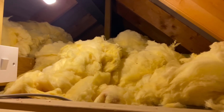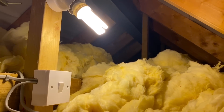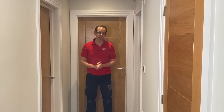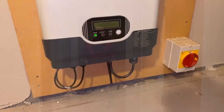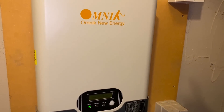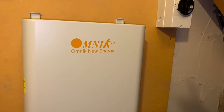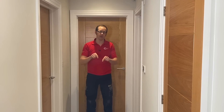One thing to think about in all of these categories is that if the loft is being used and contains electrical equipment — so if you have a lovely loft conversion or a new-built room up there — then you should have a smoke alarm installed, as this should be considered part of an escape route. Or another situation may be that you have electrical equipment such as boilers, photovoltaic equipment or uninterruptible power supplies in an unoccupied loft space. Suitable fire detection equipment should be installed there also, because a fire breaking out up there won't send smoke down to trigger an alarm until it's far too late to take action.